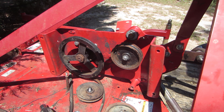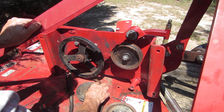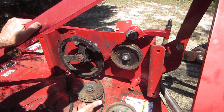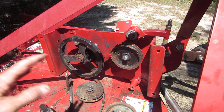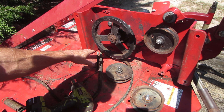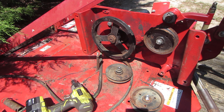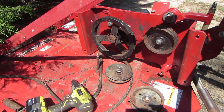That's what we're doing today — taking this down so we can order the parts. I might have to use a puller; I don't use them very much on these, but I've got one. A lot of times I'll just put the nut back on and tap around them, and sometimes with a little leverage underneath they'll pop right up. To pull the angle gearbox out, it's really not difficult on this one — there are just these three bolts holding it down, and then one other small bolt right here, a 9/16, that you take off. It's kind of like a spacer or center support bolt.